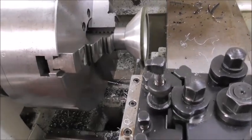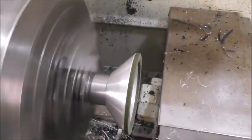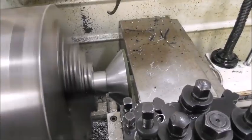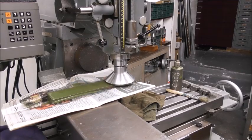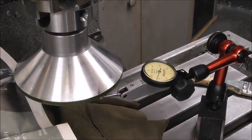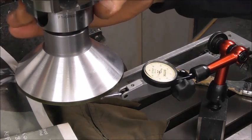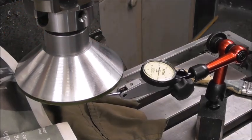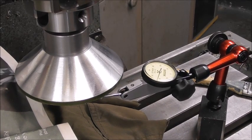Have a look at the run-out on this one — it's shocking. That took a millimetre — 40 thou — to clean up. I'm getting two benefits: I'm dressing the old rounded oilstone flat again, and I'm truing up the diamond wheel. Let's take the diamond wheel out and have a look at it. It's running true now, and I was only doing it for a few minutes. You can see it's registering the roughness of the wheel, but it's running true and it's true in line with the axis. We've trued up the wheel.